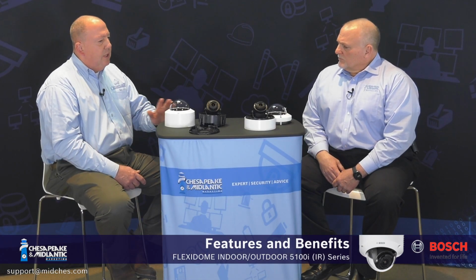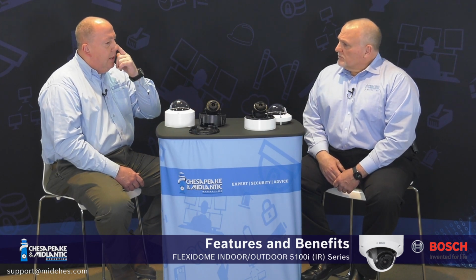There's a couple things that are different that are specific to the exterior model. Do you mind covering those? Sure. So the indoor version is powered by PoE, power over Ethernet. The outdoor version does give you some more capabilities. It's PoE, 12 volt DC, or 24 volt AC. So in a retrofit market where maybe you're getting media converters over fiber or extending Ethernet and you need to power it up locally, you can do that now a lot easier.